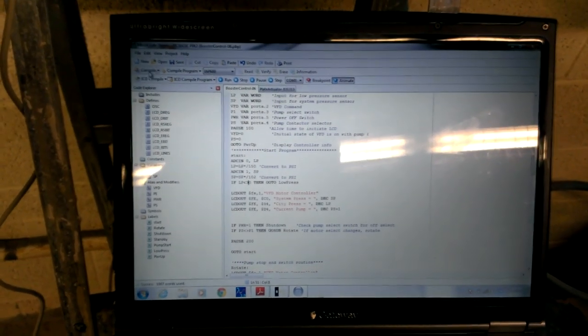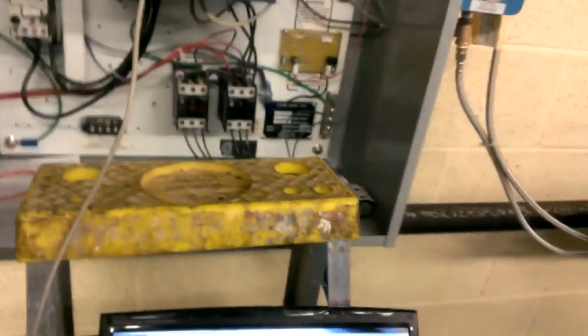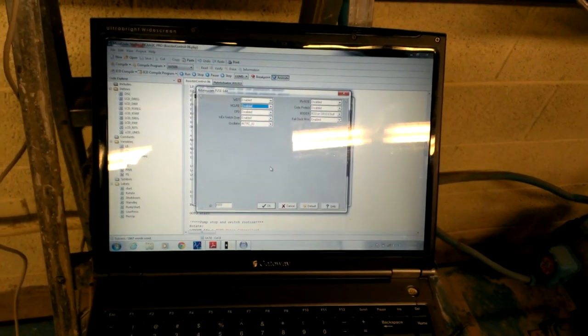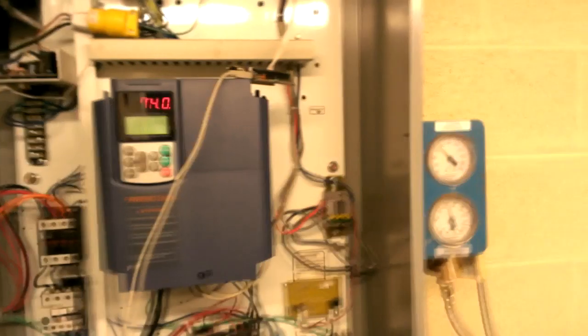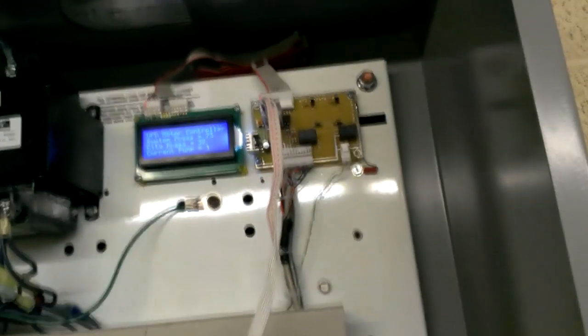It's never going to read that low because of the voltage coming out. I'm going to stop the pump — definitely don't want the VFD running when I'm writing the program to it because it will interrupt whatever it's doing. So I'll mess with it for a couple seconds. But basically it's running great — I'm just adjusting the scale of the pressure readings. Again, that's only for my own diagnosis and also to operate the low pressure cutoff and shut off the water line. About 65, 60 — yeah, pretty close.